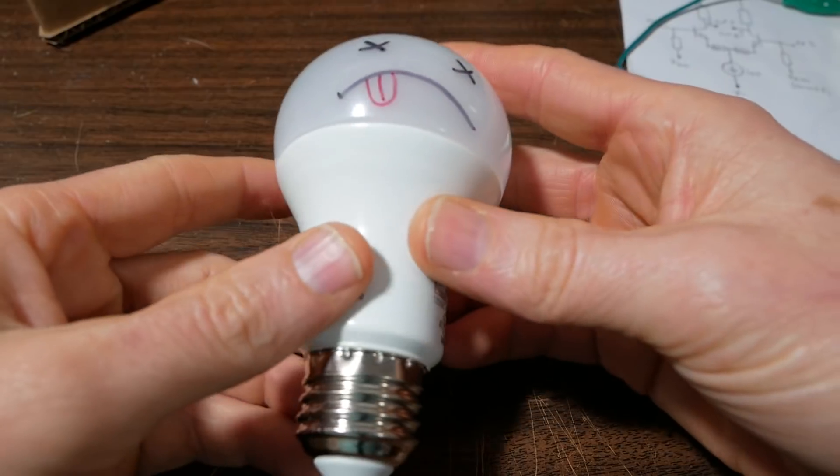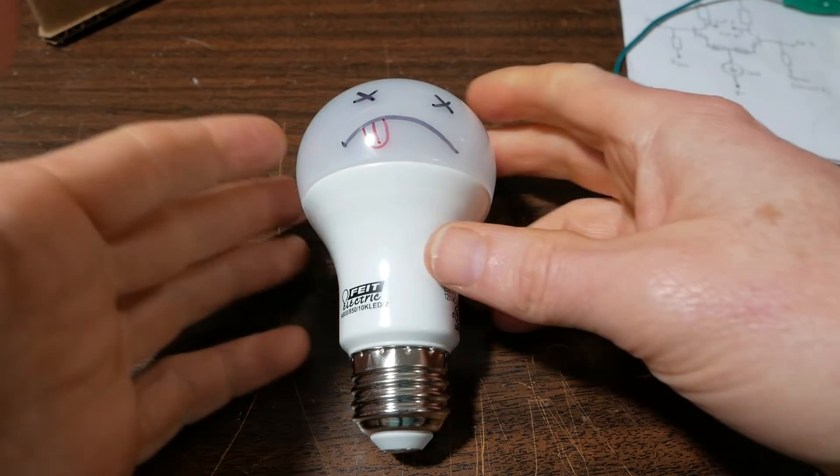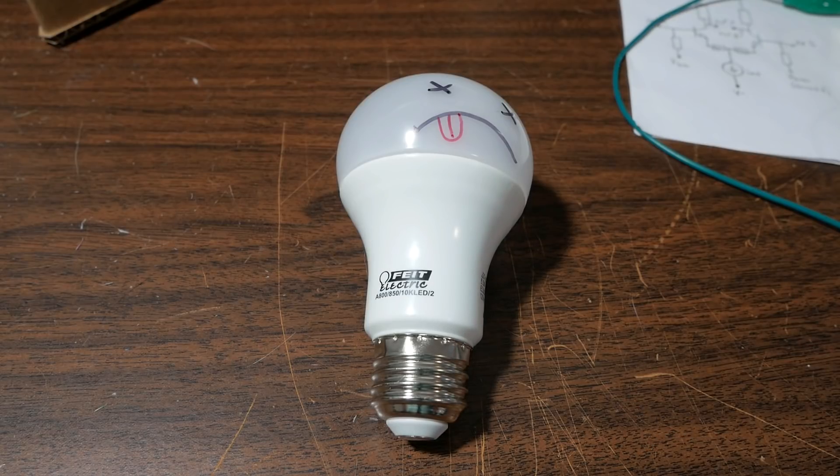I really like these bulbs. I have about 12 of them around my house and I haven't lost one yet. I have some in totally enclosed fixtures on the outside — they come on at night automatically, and I put them in two years ago and never had a problem. But this came from my parents' house and it burned out. It was in a ceiling fixture with a glass globe that screws on, holding two bulbs inside, and the other bulb was an LED of course. You don't want to put an incandescent in with it because of the great heat build-up.